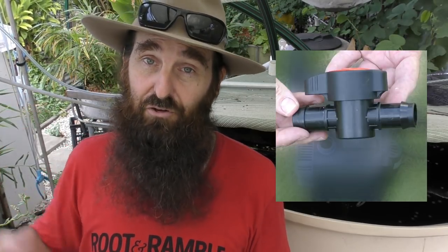Basically a big stuff-up on my part. One of the ways I could have avoided this is by placing a second valve at the other end of the top-up line — something I keep meaning to do. Generally when I'm topping up the sump tank I come down, eyeball it, and if there was a valve there I would have turned it off, then walked up and turned off the second valve — a little bit of a fail-safe. It's a big stuff-up and I'm really kicking myself, but I thought it's one of those lessons you folks can hopefully learn from my mistake.